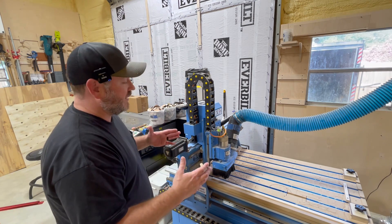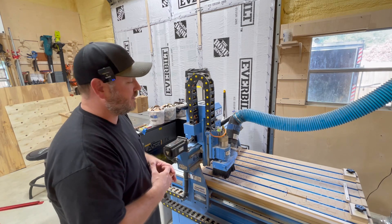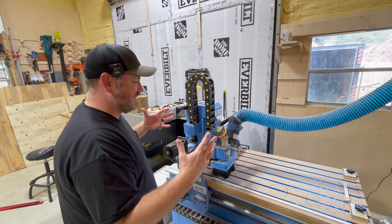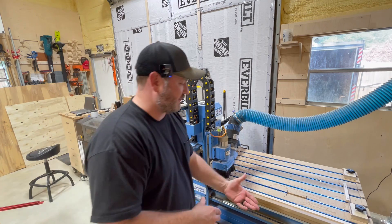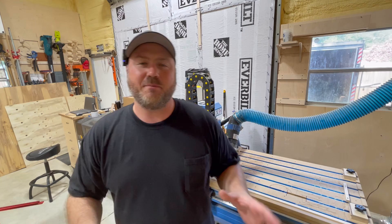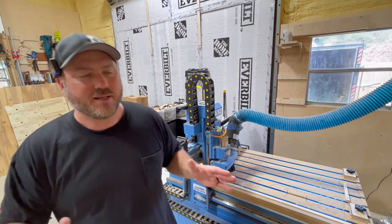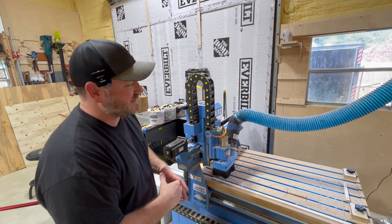It's actually been really great. I've actually trimmed this thing down quite a bit — probably like five or six different flattening passes we've done. But you can see here I've actually gouged the surface a little bit. I don't have to replace these too often because I've got this business kind of dialed in. My bits only go down a certain percentage lower than the actual plywood, and the only thing that changes is the thickness of the material by like a hundredth of an inch or so.